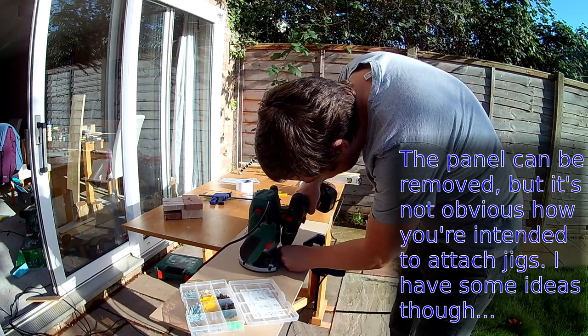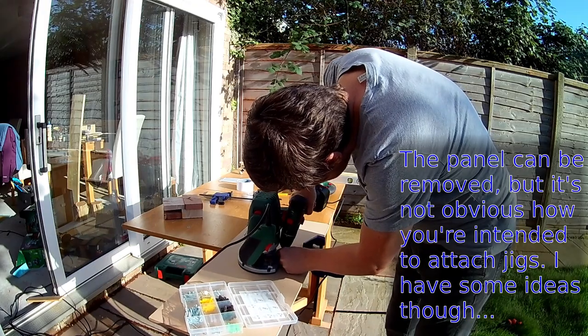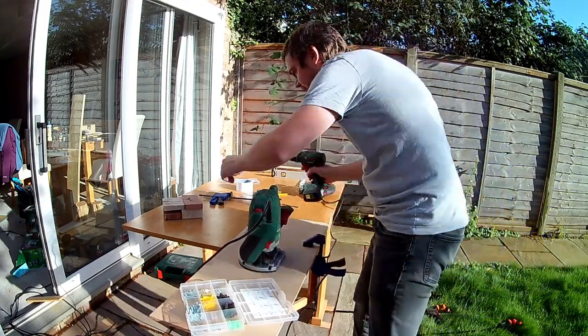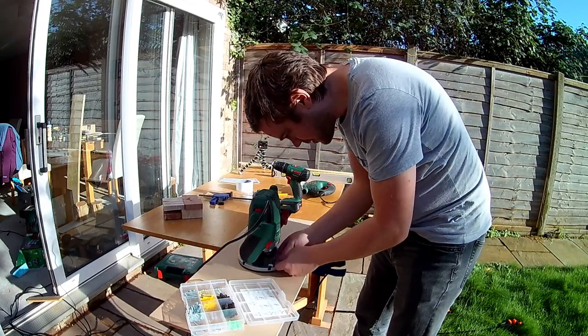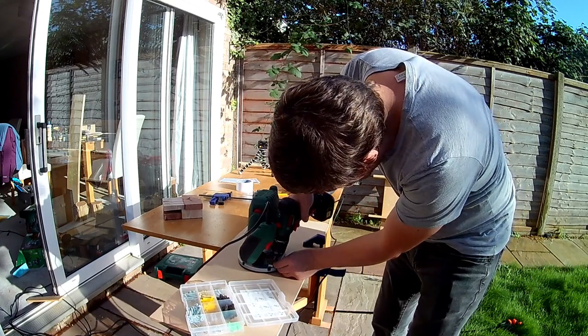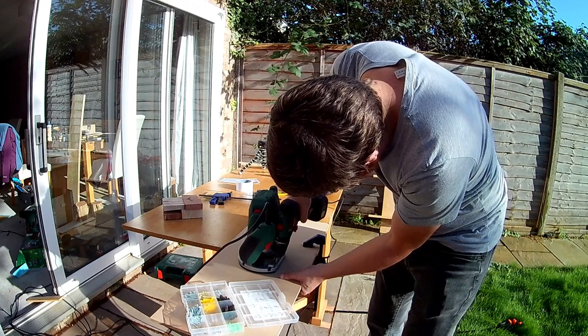For now, I've passed a couple of screws through holes in the base and into the MDF using washers to ensure they stay secure. However, in the long run, I intend to replace the screws with bolts held in place with nuts. If I don't do this, eventually the screws will stop gripping the inside of the holes properly and will slip out. The screws don't need to take a great deal of force, and what force they do take is all lateral as you move the sled around,